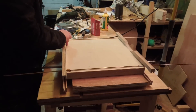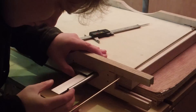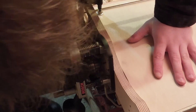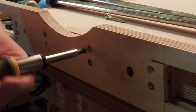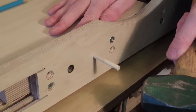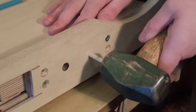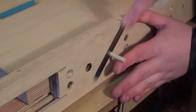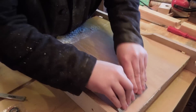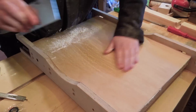For attaching the sides I used some rods and shims to get them lined up vertically, and then used a square on the pivot rod to get them lined up horizontally. Then screw holes were drilled. To make sure I can get them back in the same place after removing them, a piece of dowel was used as a locating pin. This was trimmed flush with a Japanese pull saw. I put some threaded inserts in for locking the table, and also varnished and scraped the table to reduce friction with the conveyor belt.